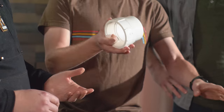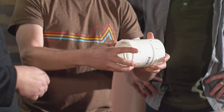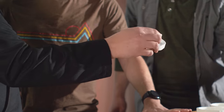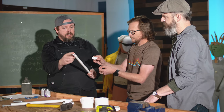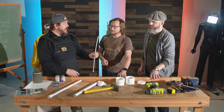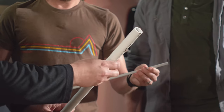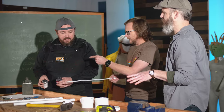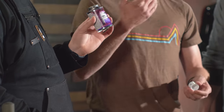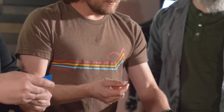So $15 — what do we need? This is a three-inch build. We have a threaded coupling, the other side in reverse to put those together, a threaded cap for the bottom, and a half-inch cap for the top step pad. We need an adapter or union for connecting two pieces of the same size pipe. Then we have quarter-inch flexible PEX tubing — the kind behind your refrigerator. Also three-quarter-inch PVC pipe to hold the CO2 cartridge, epoxy, PVC glue and primer, and a number-eight half-inch screw — that's the puncture.